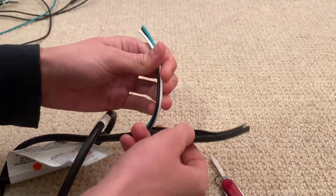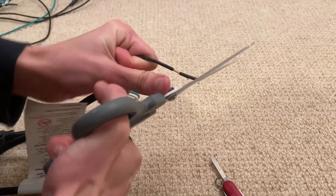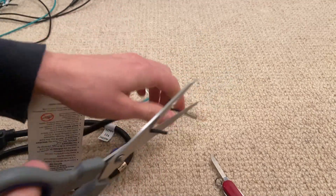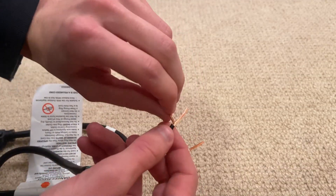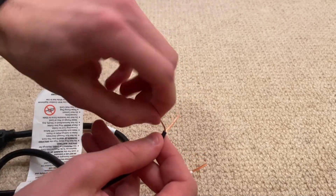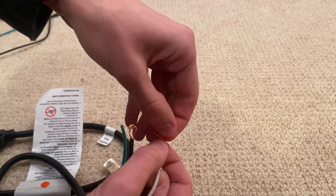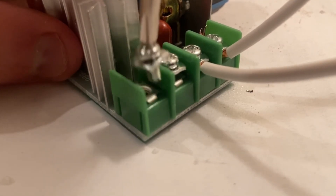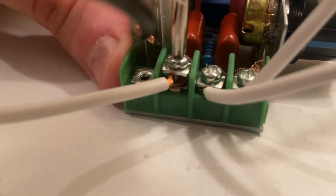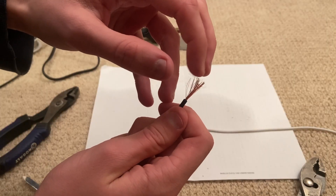This process is actually quite time consuming, so I've sped it up ten times and it still takes forever. Next, we are cutting off the outer casing so that I can actually work with those three wires, and then stripping off that outer casing on just the ends so that I can work with the smaller wires in between. There are wire strippers made for this, but I've always found scissors to be a lot easier. Now I'm splitting off some of these strands and making a loop shape. The idea is to have this loop so that I can put a screw through it and mount it to a motor speed controller — the only device I was able to find that can actually handle the amount of power coming out of a socket from the wall, the 120 volts AC. Here I'm removing the screws, the wire goes in with the loop, the screw goes back on, and there are two input sections and two outputs. The idea is I can control the flow of current using that dial on it.